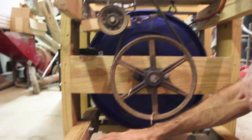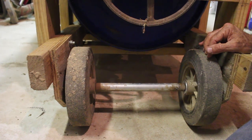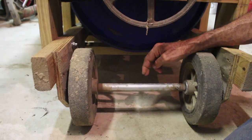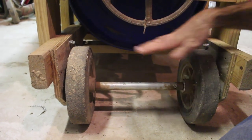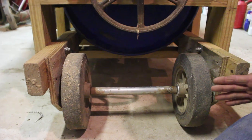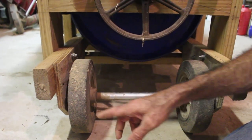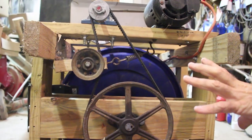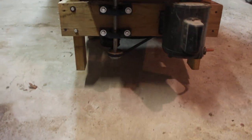This here is in the Whiz-Bang thing — these are two wheels off of a Home Depot-type rack system that you push around in the store. A friend of mine had bought a bunch at an auction and I got two wheels from him. I took a piece of regular three-quarter inch pipe, put it between them, ran a half-inch rod through it which fit the wheels perfectly, and mounted them on here so I had something to roll it around with. You want the frame to stick down just a little bit lower than the wheels so that when you stand it up, it's sitting on the frame on a hard surface, not on the wheels.